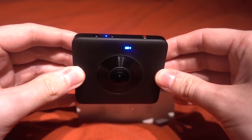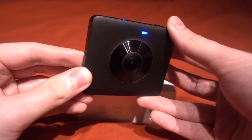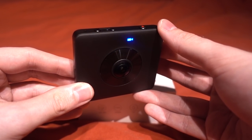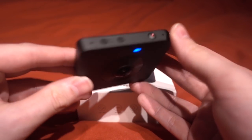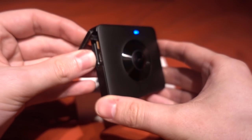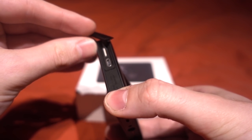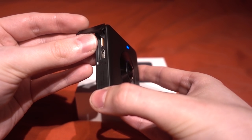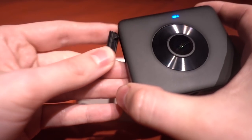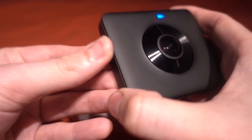There's an indicator on the front showing which mode it's in, plus a battery indicator that goes red when charging starts and when the battery is low. The battery is a 1600mAh Li-Ion giving about an hour of recording, which isn't bad at all. It uses an Ambarella A12 chipset for processing, and the camera sensors are an IMX206 16 megapixel sensor. The camera does get pretty hot while recording. It also has a stereo mic with two inlets on top.